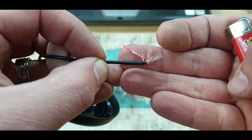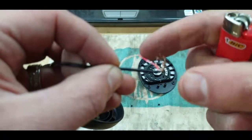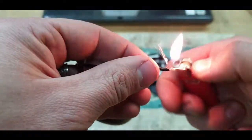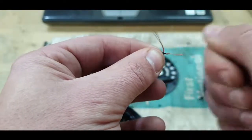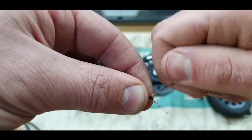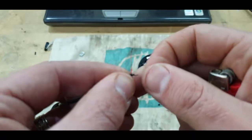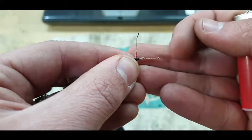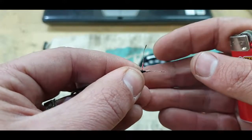and normally to get rid of that fluff that's on the inside that keeps the strands from being loose, I just take a lighter and just burn them all off. Gonna be ones in the red one as well. Okay, and just twist them together. And the problem is each of these strands has got insulation on top of them, so it's very difficult to get soldering to stick to this, and it's very difficult to get that insulation off without breaking these strands. So I've tried various things in the past. I take my knife and just scratch off the points, or I've used excessive heat to try to burn off the insulation. I'll see what works this time.